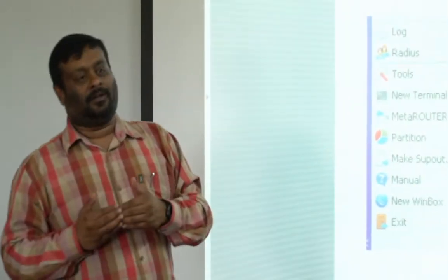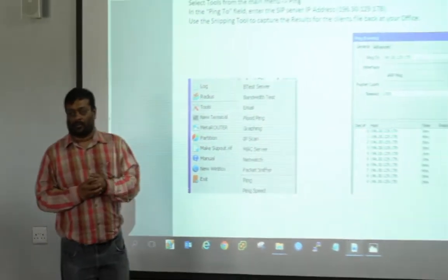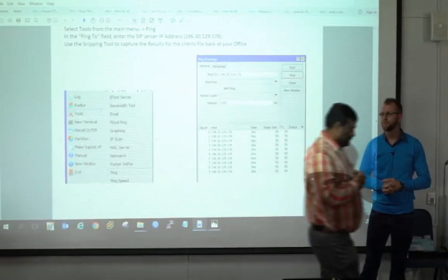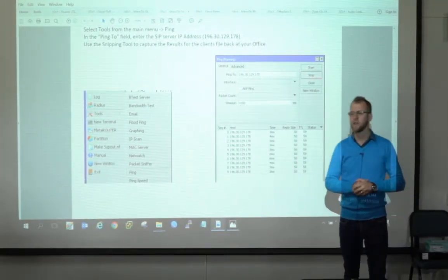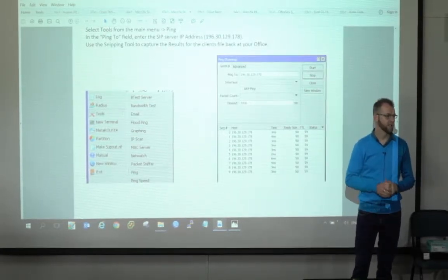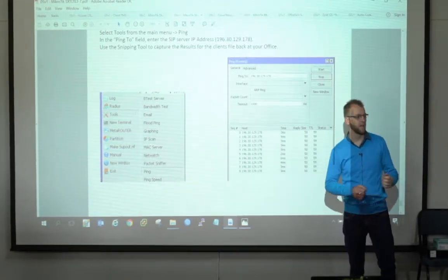But that's why you can mount it where the signal is, close to a window, whatever the case may be, and you can run a cable to it. So install it where there's best signal. Do not switch it off, so nobody goes there and just unplugs it and brings the comms down. Also, if you install it in a different location from the server room and you're using the client's multi-plug or a plug over there, try and take tape or cable ties and fasten that plug on there so that the cleaner doesn't come and unplug it to plug in a vacuum cleaner.